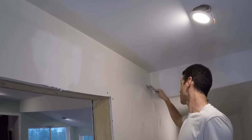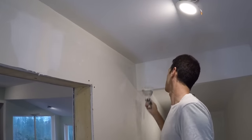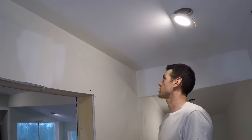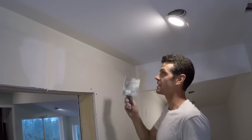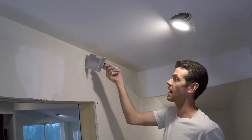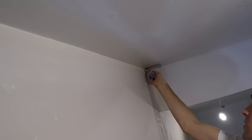Okay, into this corner — right here. So it's not the worst thing I've ever seen, but I see a lot of sanding. I see too much mud buildup inside, and what's going to happen with all this mud in here is it's going to shrink and there's going to be a hairline crack. So I don't like that.